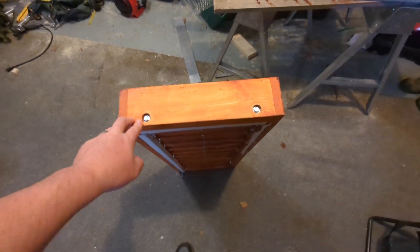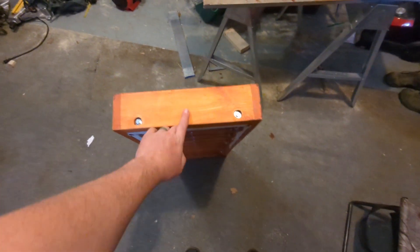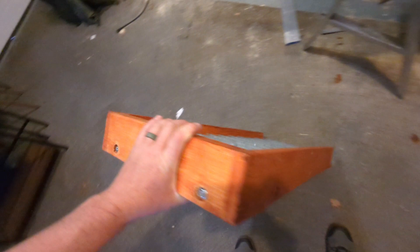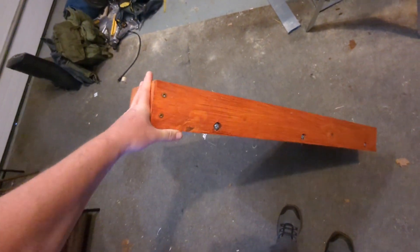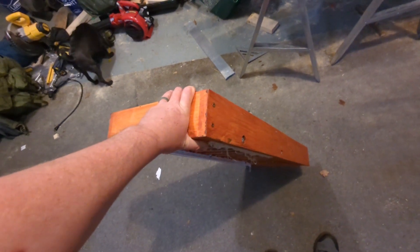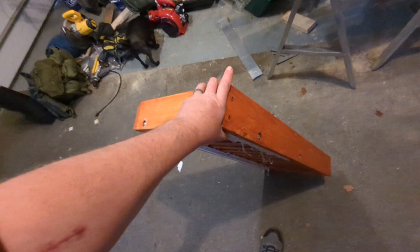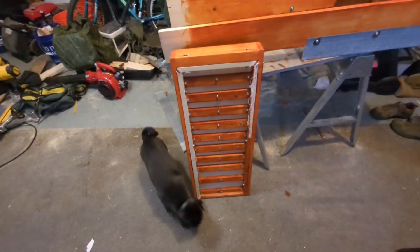So this is the backside — the spot where the constraints are going to come in. To keep that interior frame secured, I've got two 7/16 bolts. You saw the nuts in the earlier view of the backside. And then on the sides, same thing — 7/16 bolts that secure the riffle frame to the outer frame. So that'll be pretty easy to take apart when it's time to modify. I just ordered some toggle clamps from Home Depot — those are on the way, and that's how we'll secure this to our bellows box. We'll make a video of that when we get that done. They're threaded so I can actually adjust the lengths and keep this nice and tight. I'm going to install the seals next and we'll show you how that goes.